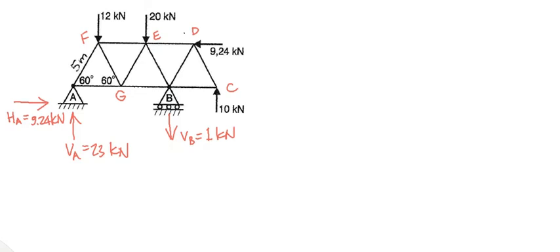Many students, this is the first lesson on Method of Joints. There's the frame from page 6 of the first document, Principle of Moments. If you remember — well, I'm assuming because you went through it — we used the Principle of Moments to find these reactions here, because whenever you solve a frame, solving a frame means find the size of the forces in all the members, and also whether the forces in the members are tension or compression, which we call the nature of the forces.